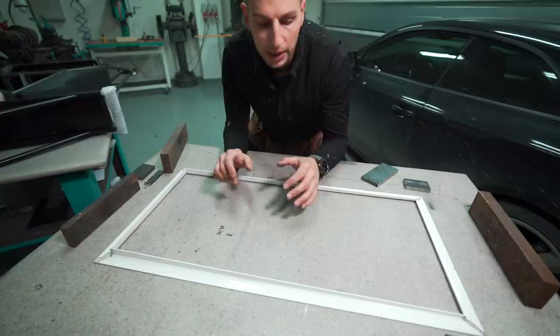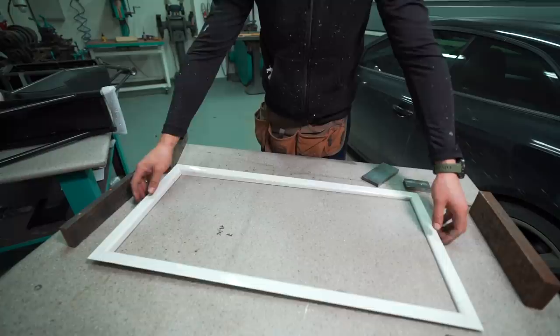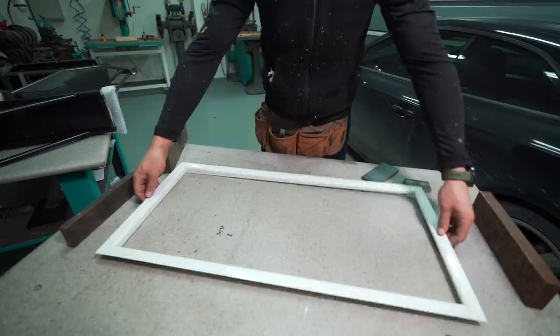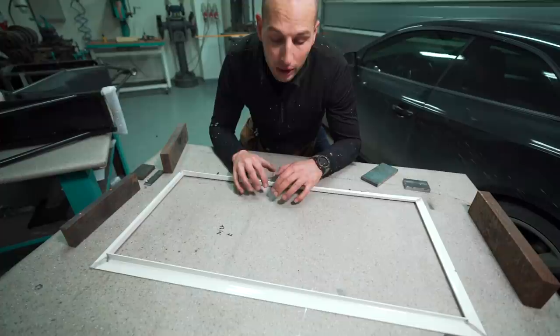This technique with just a hot glue gun is actually pretty interesting. And if you don't believe this might be strong enough, then you're mistaken, because I already did my testing. I took this specific plastic, sanded it down with 40 grit, really rough, then glued it, cured it properly, and then I was hammering the joint like crazy to break it apart. I've done this a while ago for a completely different purpose, and this time I knew what I can do.